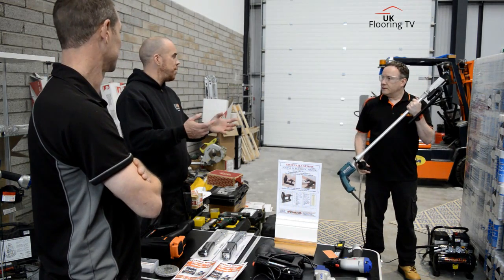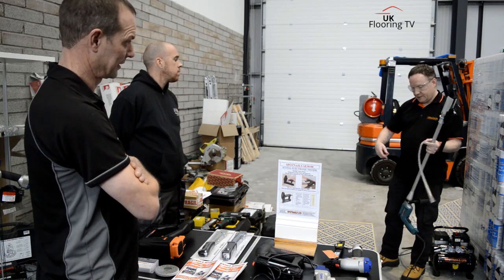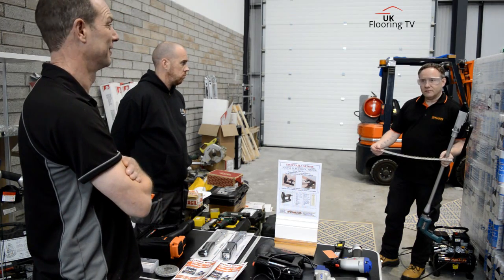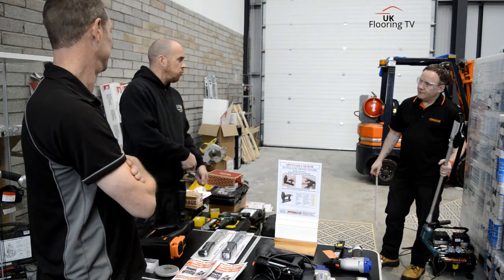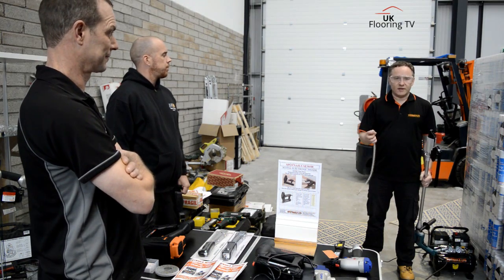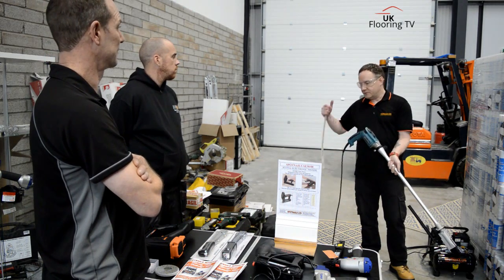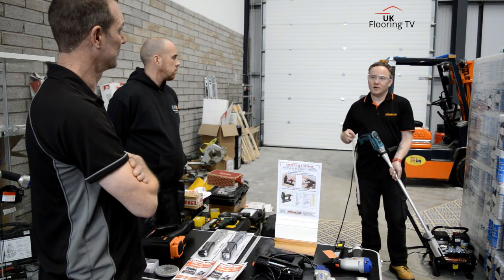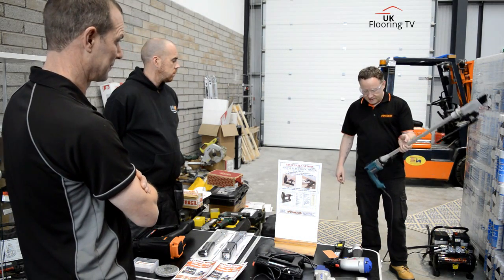The only thing is you've got to be standing upright — you can't put it at an angle. If you're standing up, you force on there with a side handle to steady yourself. The other good thing is with these screws on this strip, if you finish for the day you can set that out, and even if there are two or three screws left you can put it back in and use those up — no wastage whatsoever. Because they're on the coil they're not going to fall about in your van. The box is flat so you can literally lay them flat. You'd fly through a room of ply with that — it pays for itself on the first job if you've got a lot of ply to do. I've done demos at major stockists where two guys watching said 'I'll have one' without even knowing the price — because they didn't want to bend down. It's a fantastic piece of kit.